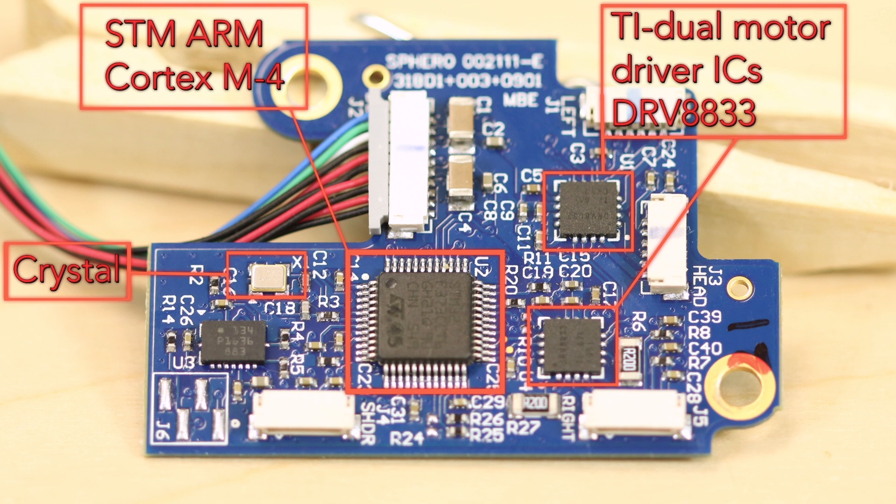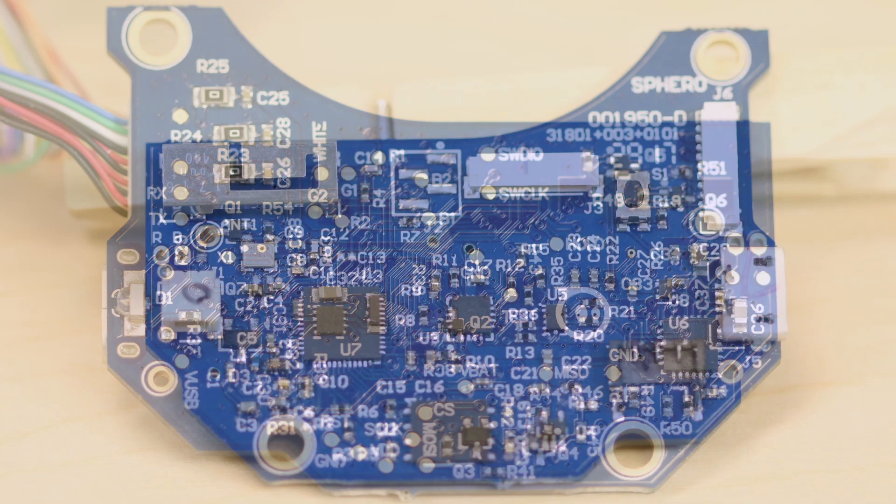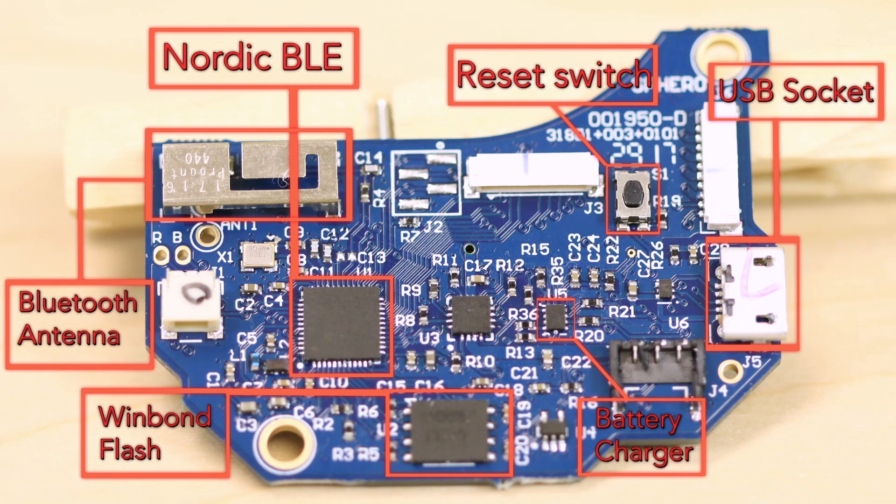You need position feedback to move the turret or change the angle of the arms, and you probably need velocity feedback to handle the track motors in R2's feet. We're guessing the feedback loop in the track motors is probably a velocity loop rather than a position loop because the velocity loop is easy to implement. The other main board contains an audio amp chip to run the speaker and generate the sounds that give R2 a lot of his personality. It also contains the Nordic Bluetooth chip and antenna, a reset switch, and the battery charging circuitry and USB charger socket.